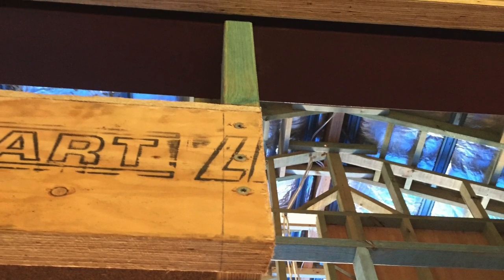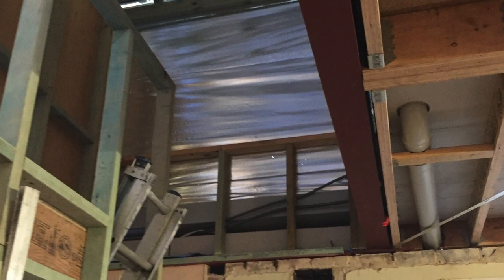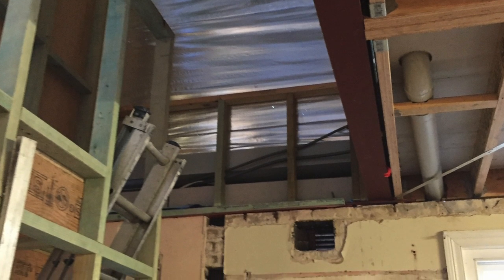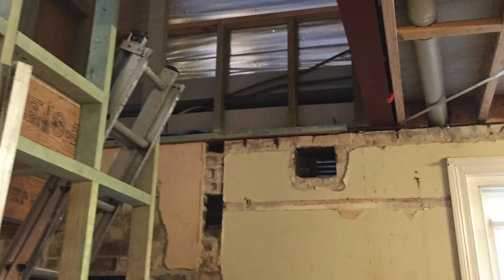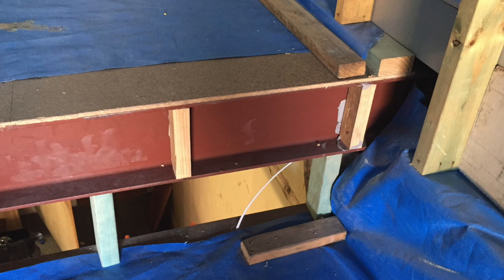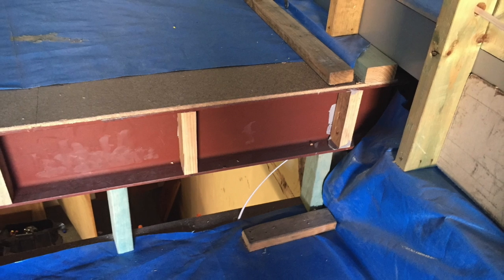And then you've used steel beams. It's just the one for the second floor as well. Yeah, one steel beam there because that gives us support. A couple of reasons that steel beam's gone in. The bathroom's heavy. You see how heavy those double LVLs are there. They're sitting on the wall and on that steel beam there. So that supports the whole bathroom and its weight. The other thing it's allowed us to do is sit those double joists that go up and support the roof above on that steel beam too.